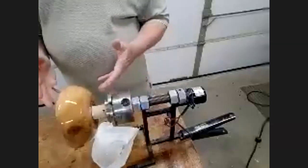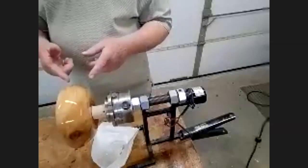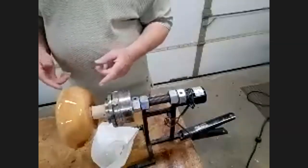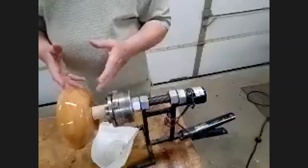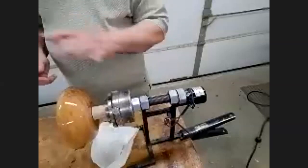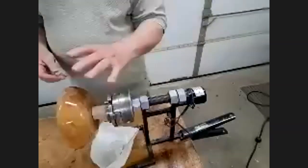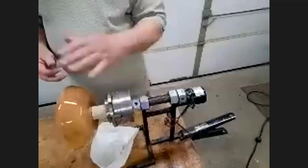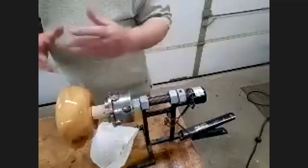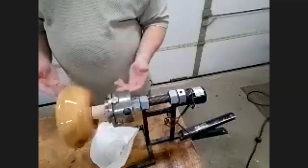It has about a 10 minute timing to set up. So after a few minutes, like right about now, you should come back with some type of a heat gun just to get the air bubbles off of it. You don't want a whole lot of heat — just a little bit and it'll take most of the air bubbles out. Then once it dries, you can come back and sand it and put another coat on it.